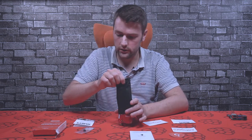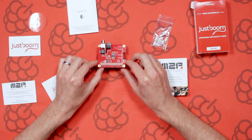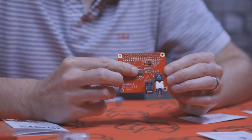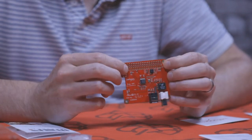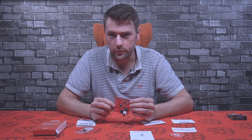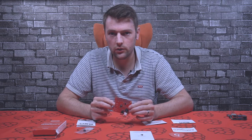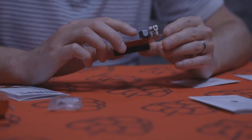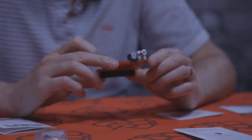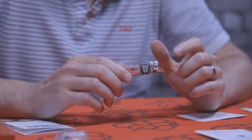Let's take a look at the Digi Hat. It has a Wolfson digital audio chip, and a 40-way header — not all GPIO pins are used by the hat board itself. You can find the exact pinouts at justboom.co in the technical guides area. The board has an optical output — I'd recommend a cable no longer than two to three meters — and it also has a coaxial output with an isolator.